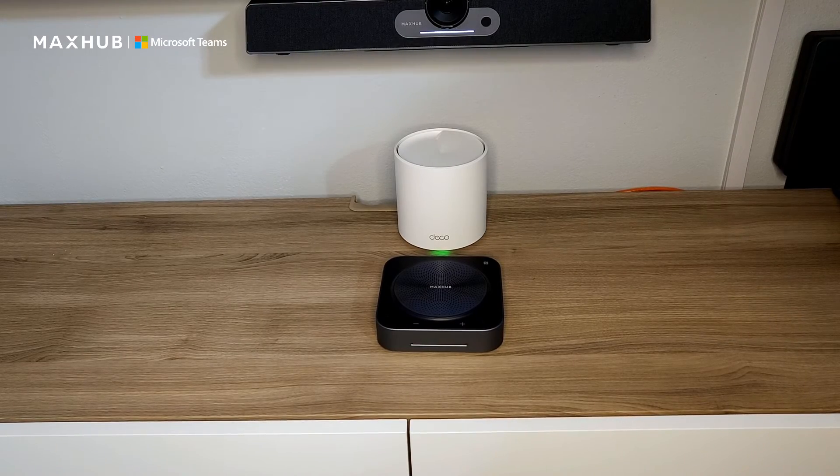Let's talk about the award-winning BM35 speakerphone. The BM35 is included in the XT10WS kit and connects to the TCP-20T touch console's USB port through the included USB cable. The BM35 has eight microphones, two on each side, for advanced omnidirectional voice pickup. It uses built-in intelligence to actively cancel background noise and bring your voice into the meeting up to six meters away. The BM35 also automatically adjusts participants' voices to a consistent level. Using dual-driver technology, the powerful BM35 can reproduce sound loud and clear from 80Hz all the way to 18kHz without distorting.